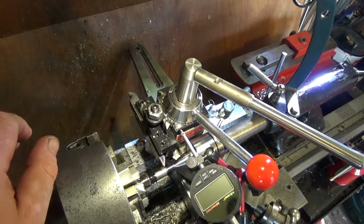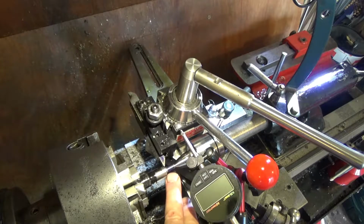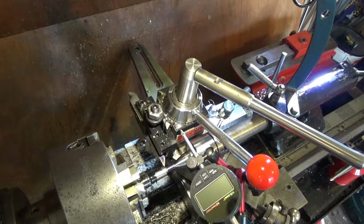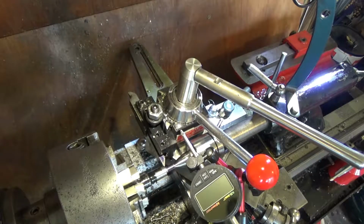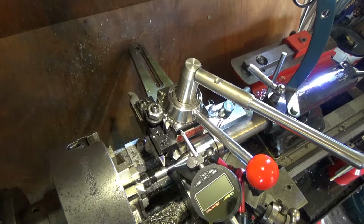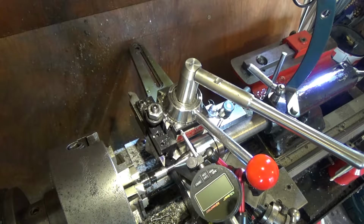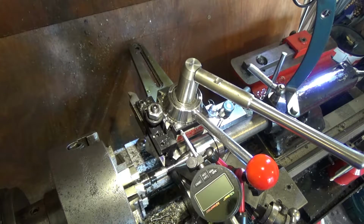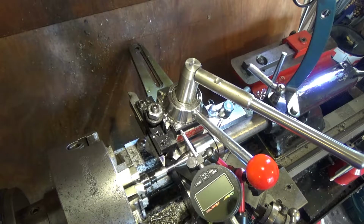What we're looking at is the blue marked out area on the threaded area here. I've relieved it down to 242, I think it is, from 312. I've now got to take 23 thou off of it, so I better write that down before I forget, otherwise that's 23 thou per side, so I'll write that down there. And then we'll put the wire gauges on it. That should be 23 thou, the maximum allowance depth of cut, the biggest diameter. Obviously we don't want to go down to the minimum diameter straight away, otherwise the threads will be slack.